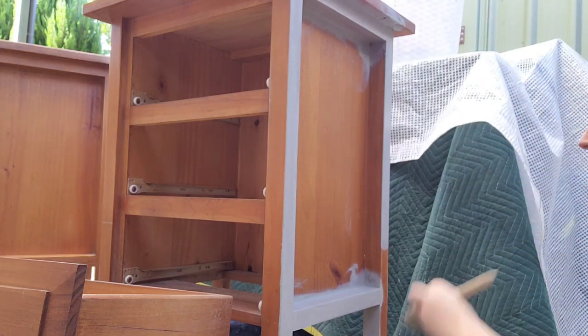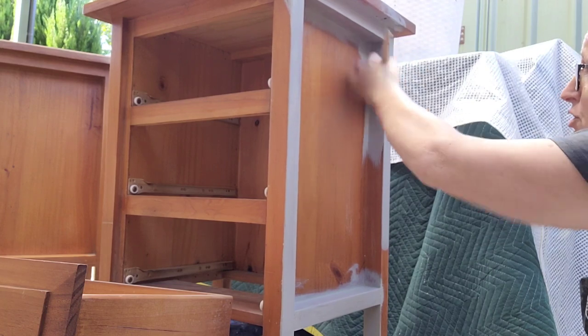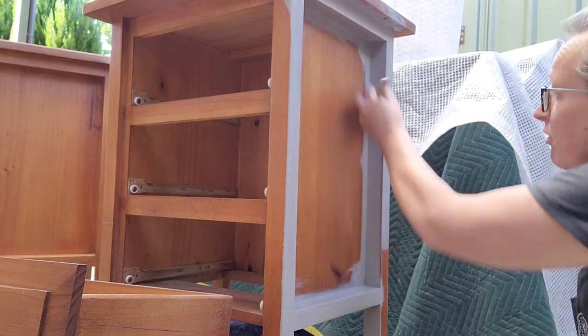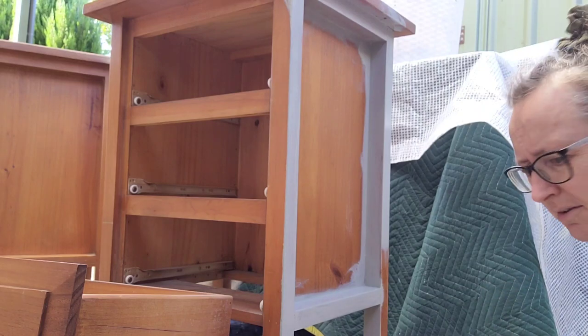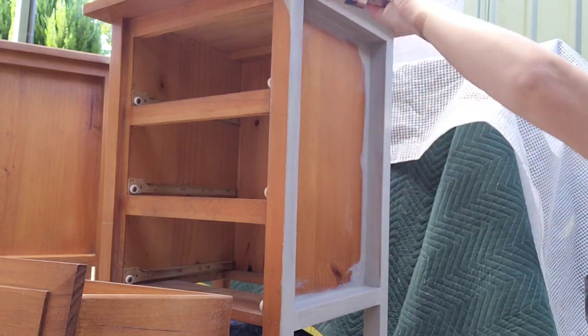This is lovely — it's really similar coverage to the olive that I use. I'd say this is going to be a two-coat job, which is great, maybe two and a half. It's a really lovely, really nice grey. What I'll do is I'll do one coat, wait for that to dry, then do a second coat, and then I'll give it a really smooth sand — just taking any roughness off. When you first feel it you'll think it doesn't need it, but when you do it you realise the difference. It just goes really buttery soft.